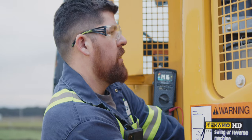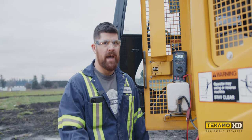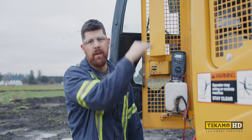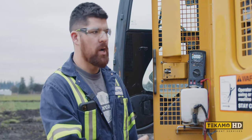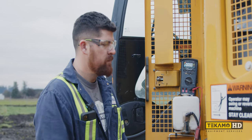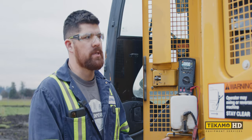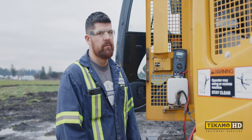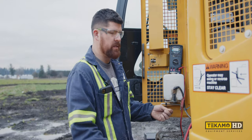There are no more amps because the volts are the same. If our resistance is the same and our voltage is the same, why would amps change? If you've got a low-amp alternator, you're going to put this on and those batteries are going to pull down your voltage — you're going to go from charging at like 14.5 to maybe 13 or something. Then you've got to idle it up until you hit that 14.5 or 14, whatever your voltage regulator is set to. Once you hit that, you're not putting any more juice in — you're not pumping more amps through. It doesn't work like that.